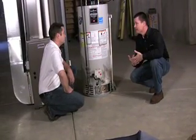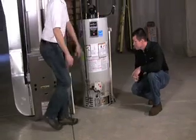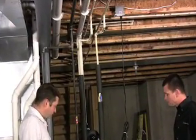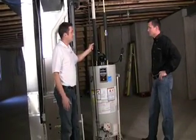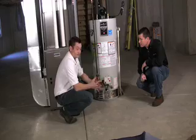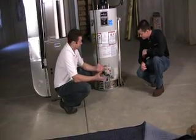Just from a maintenance standpoint, when your hot water heater goes out, what are the things you're going to want to check right away? Basically, you want to make sure that you have power going to the unit — that's the first thing. This particular unit is plugged into a GFCI receptacle above, so there is a switch there that you can check. If you confirm that you do have power to the unit, make sure your gas valve is turned on — kids can turn it off by accident — and that the switch is turned to the on position. And if all that is confirmed and you still have no hot water, there is a little green LED status light here which can give you an idea of what's going on with the unit if there is a problem.